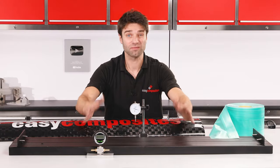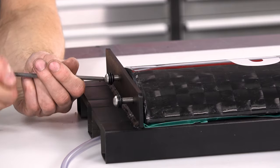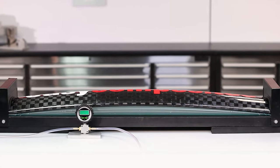So this is the test rig that I've devised. Fundamentally it is a very simple thing. We just have a steel frame with two steel uprights that we can mount into the end plates of the wing, and then between those two we can put our bladder which we can then inflate to apply pressure or force onto the wing itself.